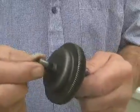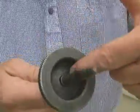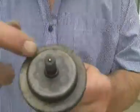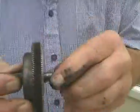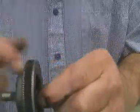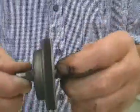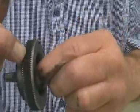The shaft itself, and then we have 2 metal pressings. This one here, which is quite deep, and then on the other side another one pressed out, which is shallower, and they're spot welded together, you see, forming and enclosing this central gear, angle cut gear, which is actually non-metallic. It's actually a kind of fibre or early phenolic resin or paxolin or something like that. So the worm doesn't run on metal, it runs on this soft material.